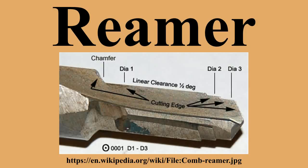A precision tapered reamer is used to make a tapered hole to later receive a tapered pin. A taper pin is a self-tightening device due to the shallow angle of the taper. They may be driven into the tapered hole such that removal can only be done with a hammer and punch. They are sized by a number sequence. Such precision joints are used in aircraft assembly and are frequently used to join the two or more wing sections used in a sailplane. These may be re-reamed one or more times during the aircraft's useful life, with an appropriately oversized pin replacing the previous pin.